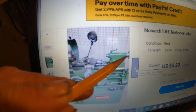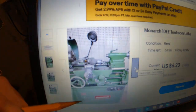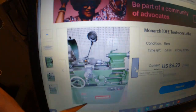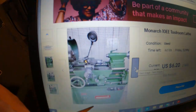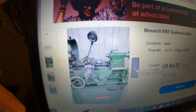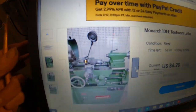You look at the tailstock and you can see a wide chrome band - that's an inch-metric dial on that. And you see this switch here - that's a vacuum tube module drive with that disconnect switch on the left side of that right-hand door. The red label indicates that this machine is probably from the early eighties. It's got the Square D switches in it - the latest style of vacuum tube module drive.